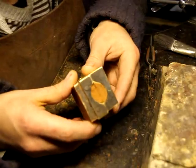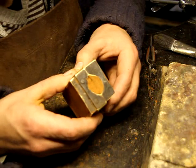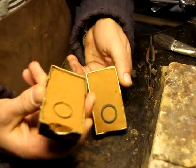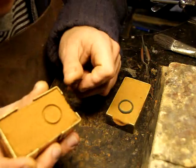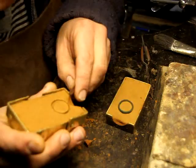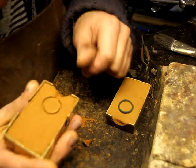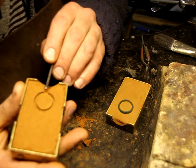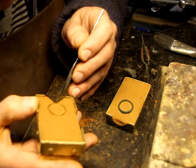All right, so there we have a form ready to be opened. Just get a little sideways wiggle to loosen it, and carefully — we can see we have the two halves ready. The next step is to cut away a funnel-like shape through which we are going to pour the silver and cast. It's worth spending time to get this neat, to ensure that no small bits of clay fall down inside the form.